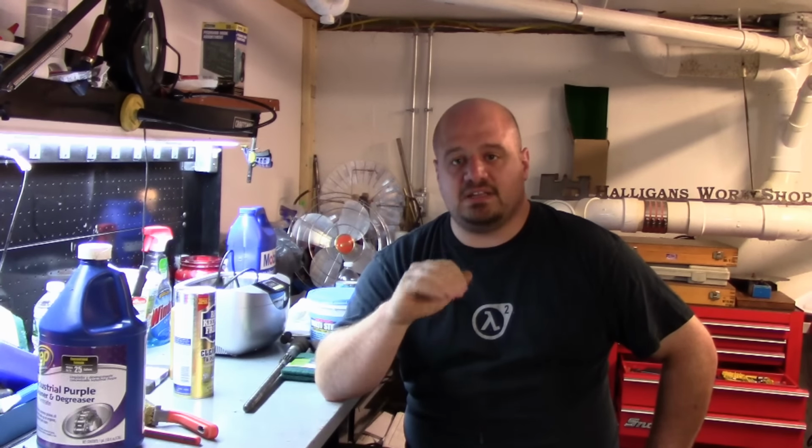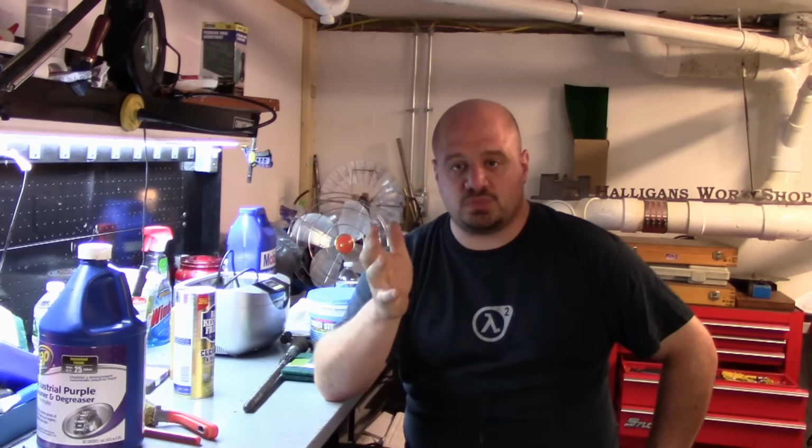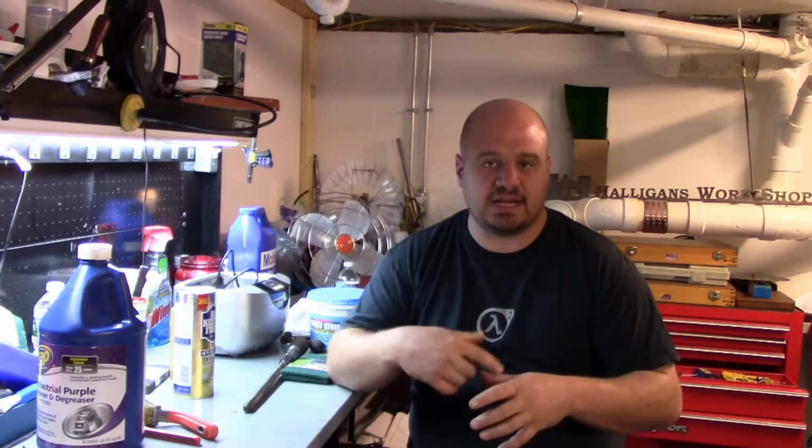And like I said, I have it in the spots you would expect. The feed screws, the bed does have some wear, and we'll show that. I've already stripped the bed of paint while it was outside, and there's a few pieces left here and there, kind of in the corners, which I just get out with a little wire brush, takes 2 seconds. The thing that's hardest to get off of these old lathes is the filler that they use. I don't know what they use, man, but that's some industrial strength filler. I got it off and leveled it out as best I can, but in some spots it's just going to have to stay, but you're not going to really see it that much. So that's not an issue.